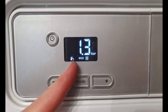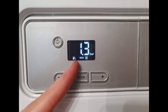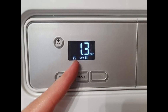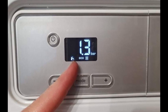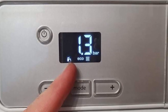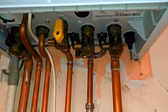If you don't have ECO in the display, you may have noticed your boiler fires up every so often all through the day and night even though you're not using it. With the ECO setting turned on, your boiler will no longer do that, saving you gas, energy, and wear on your boiler. It will take a little bit longer for hot water to come out of the tap because the boiler is no longer preheated. I've made a video showing how to turn that ECO setting on, with the link in the description below.